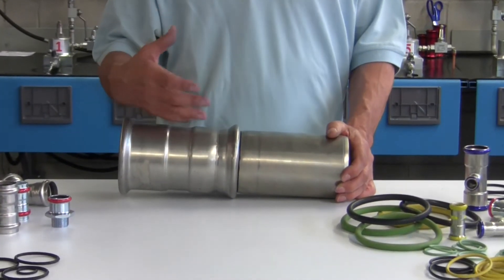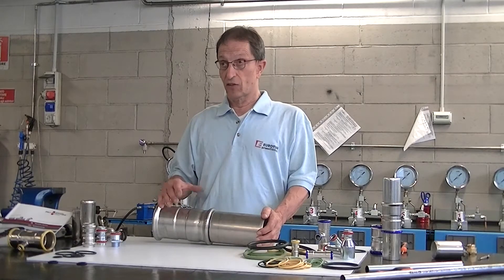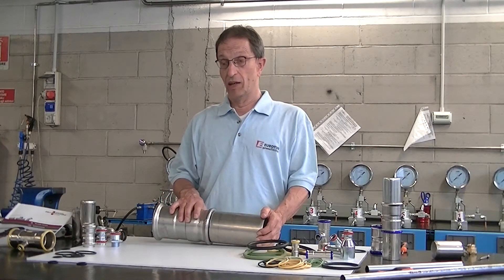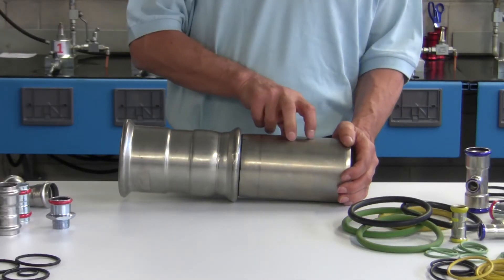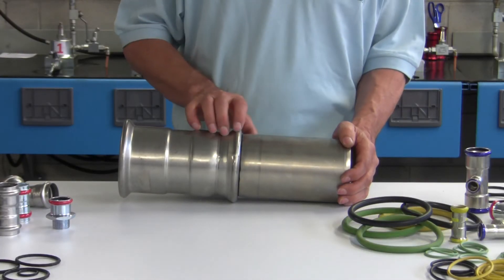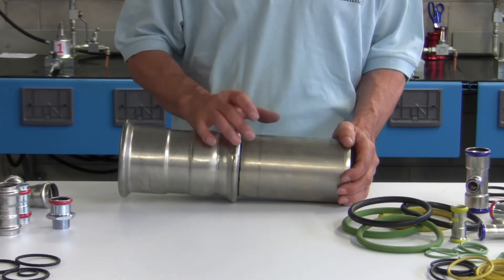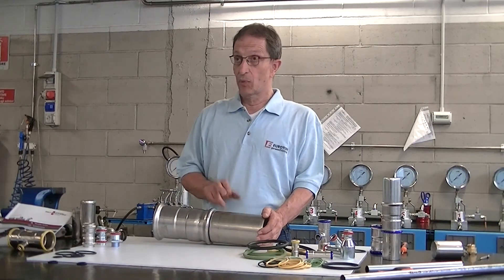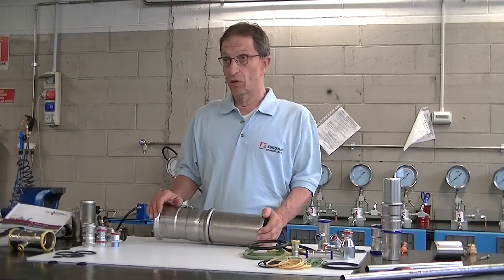Especially if the pipe was marked with ferrous material, such as a blade or screwdriver. If inside the groove made by the object there are metal scraps, there is a probability that corrosion will be triggered. Besides that, as we will see in the next video, a deep enough groove on the steel pipe, if close to a press, could lead to micro-leaks of fluid.